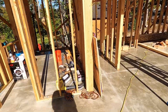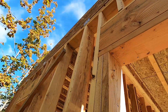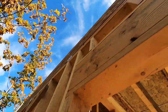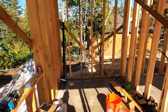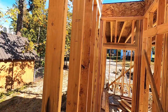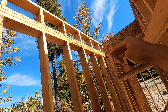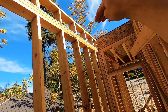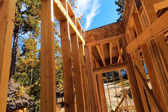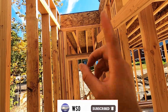Quick update here. We had to run into town and get — you can see that metal clip right there — that is a tie-down for the plate. You can see we added this extra balloon wall here that'll help carry the wall from this height up to the level of the subfloor up top, so that way it's all even all the way across when we start to stand that final back wall that's going to be vaulted, and then those other two sidewalls.